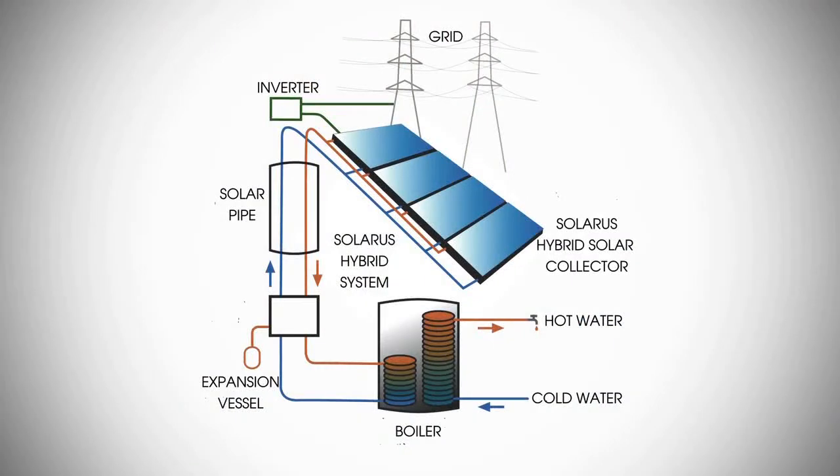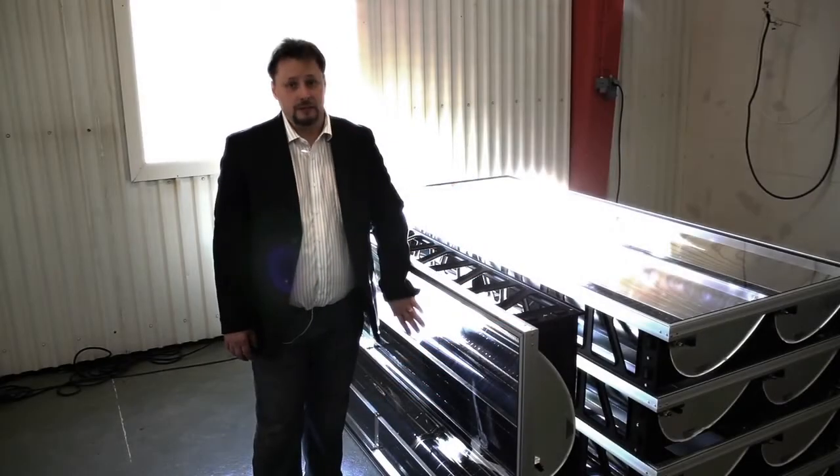When the system is producing hot water and electricity, the hot water is actually cooling the PV cells. So the PV cells are often subjected to a lower temperature than they would be operating at in a standard solar collector. This co-generation system also creates a lot more energy per square meter of aperture area of the glazing.